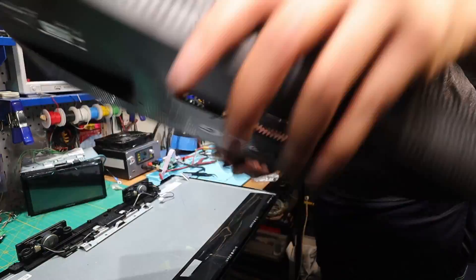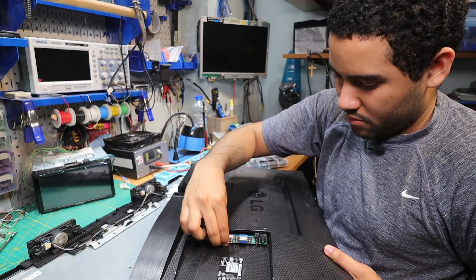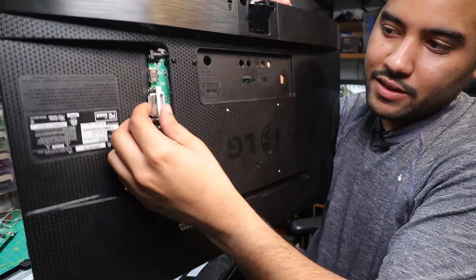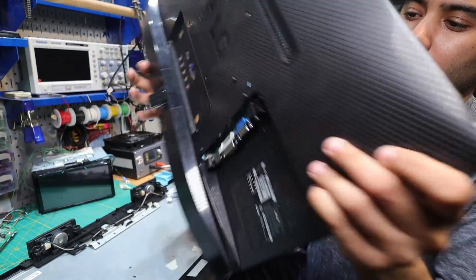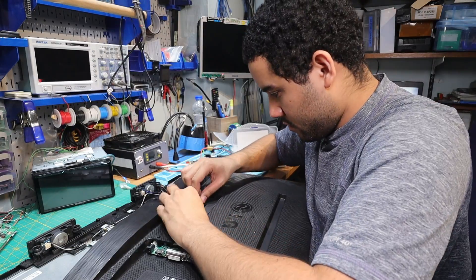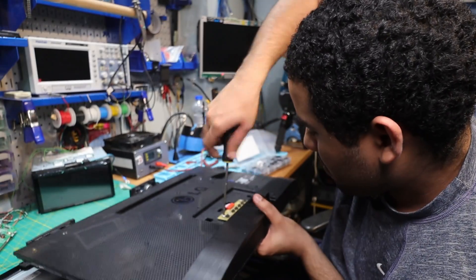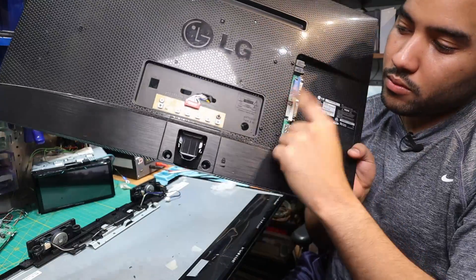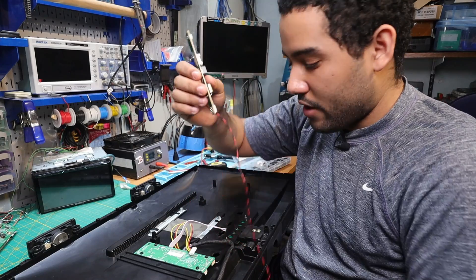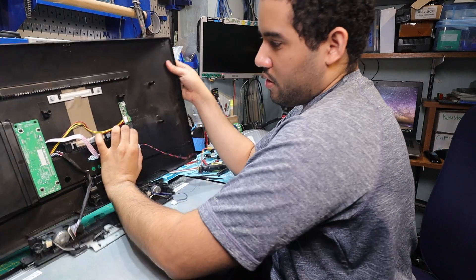I marked my four holes and hopefully they work well. There are four holes drilled here. As you can see, it's all screwed in — it's nice and tight, very strong. We have our connectors coming off the back that will run to our various components. The keypad I'm just going to screw down in the back there as well. The control board IO, main board — these are the key buttons for volume and stuff. The LED driver wire is really long so it doesn't need to be anywhere close by.